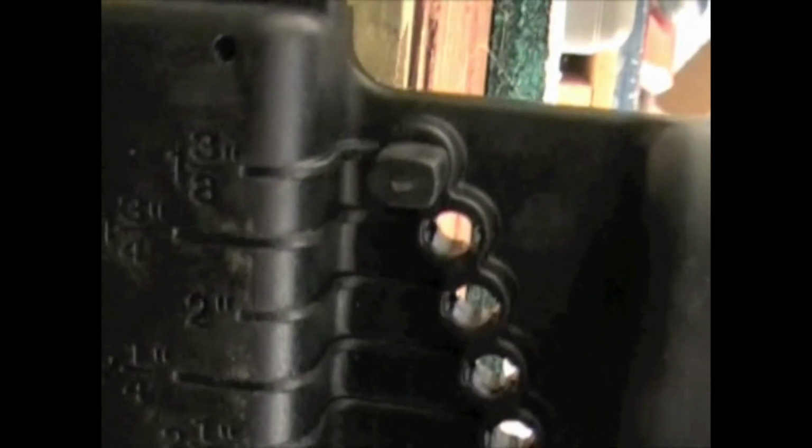But on the jamb, I don't always use that, because the door doesn't always center in the space on the jamb. It depends if there's a doorstop, the rubber weather seal type doorstop, or what they have on the door, as to where exactly you want to place that. So I do not always use the peg. Sometimes I'll move it in a little closer to the stop, like so, and not use the pegs. But if you want to center it, you can use the peg and it will center it right there. But I have found that sometimes it needs to be a little bit closer to the stop on the jamb side. So we're going to go ahead and use it on the door.